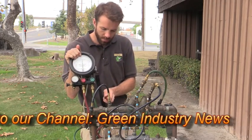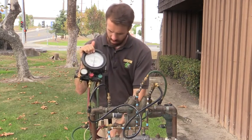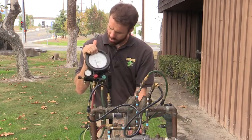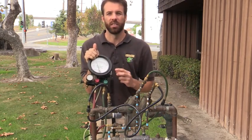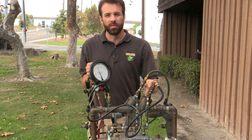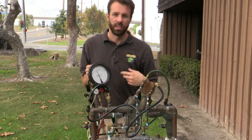By forcing high side pressure from my number one to my number four, I'm causing my second check valve to close tightly, enabling me to build my zone pressure and get a relief valve discharge. I'm going to hold the gauge up, open test cock one, and now open test cock two. There we go — we get a discharge from my relief valve at 2.6. By observing and getting the reading of the discharge, I can pass my second check valve as holding tight because I was able to build pressure behind the zone. We'd use our apparent pressure as our actual differential pressure across our first check valve.